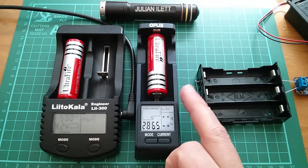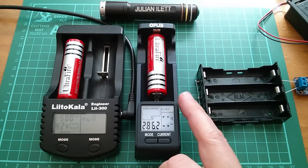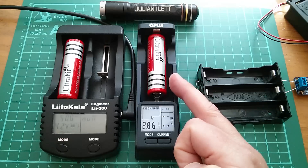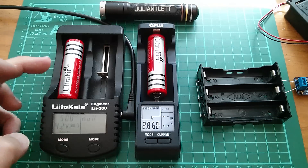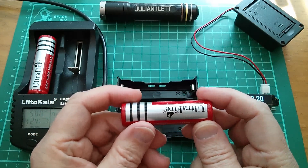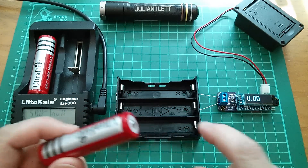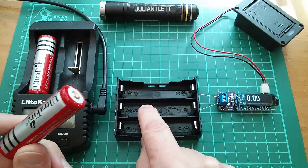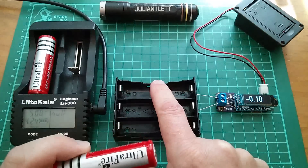A final discharge of this cell at just 100 milliamps. It's holding on a little bit at that very low current, but that will eventually drop down to about 2.85 volts. And then I can't discharge this at any lower current - so as far as I'm concerned, this cell is fully discharged. This one still hasn't said full yet. The discharge cell is now fully discharged, so I'm going to put it in the bottom holder here - that's on the V-in-minus side, so we should get a positive reading when I put the fully charged cell in.